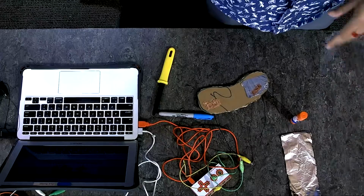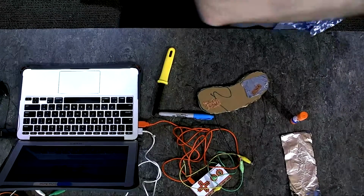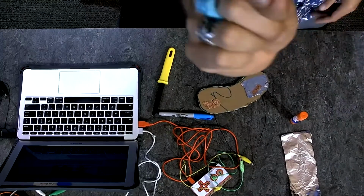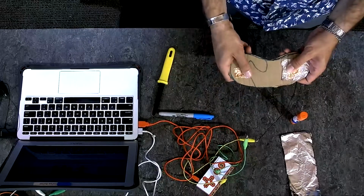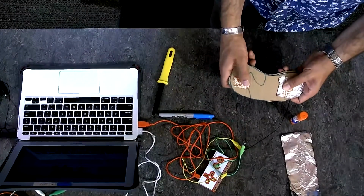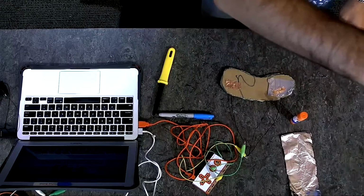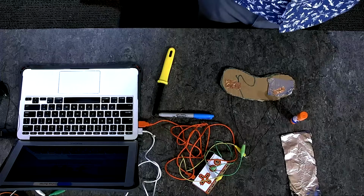It seems that if you just do the wire and copper tape, you aren't getting enough surface area. That wire is very thin. And so your button is kind of hit or miss. When I do it like that on my Makey Makey, you can see every time I'm pressing it, I'm getting the light. And we fixed Julia's by changing it to have the sandwich. And then it worked consistently.